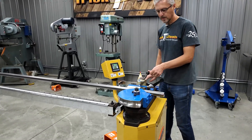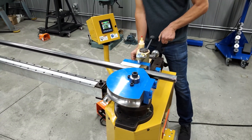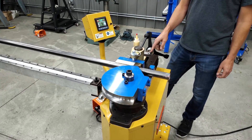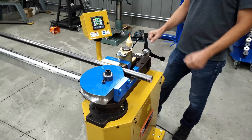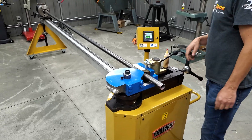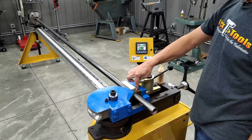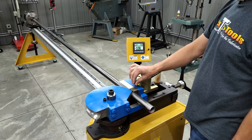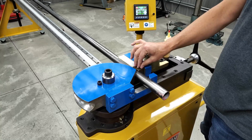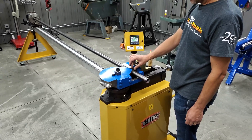Pivot the counter die in, we'll tighten the clamp. I chose 355 as my reference for the pressure — that's just a reference number, you kind of get the feel of putting light pressure on the counter die to hold it all in place. All the bending is actually happening right here in this little bronze block. As this die rotates, the bend stays right here and this is helping to pinch your tube and hold it from collapsing as it's being bent. It uses a method called pre-ovalization — it draws the tube into the die and performs all that bending right at this spot.